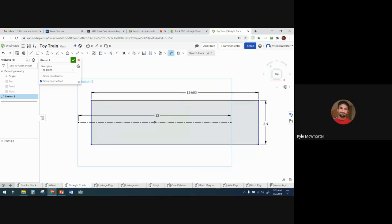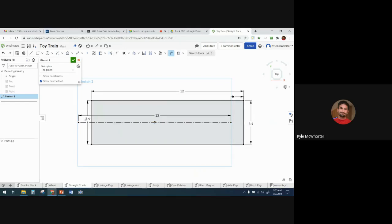The length dimension is 12 inches, and it's one inch from the end to the center. Notice that everything has already turned black because of the measurements we've already placed. We don't need to add that final one-inch dimension — that would be over-dimensioning. If I try to put that dimension on, it'll turn gray and then everything turns red, meaning bad things are happening. So I just delete that last dimension since everything is already fully defined.